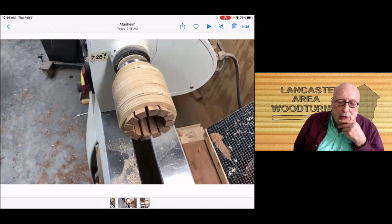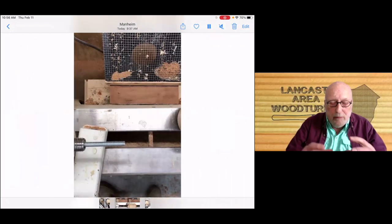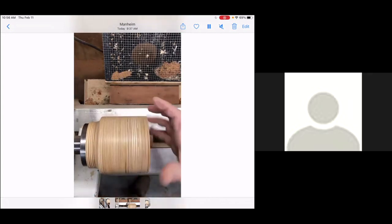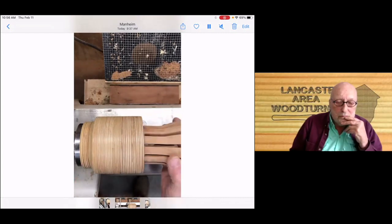Is there a taper in there once it's fully closed, or does it stay cylindrical? What's exactly the shape inside? It was cut straight at a 2 1/8 inch diameter, mainly because that's the biggest size Forstner bit I have. So it's bored about 1.5 inches deep with a 2 1/8. As it closes down, the narrowest point is right at the mouth, and it gets slightly bigger because of the taper as it goes back. If you had made that by pulling it fully small and then doing the final size of the hole, it would be cylindrical at its small size. I tried that on a previous one, like 2 days ago, and it chattered too much. The fingers, the lobes, chattered too much and you get tear out on the backside.